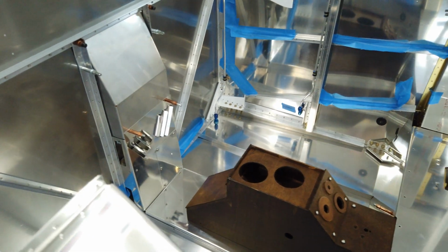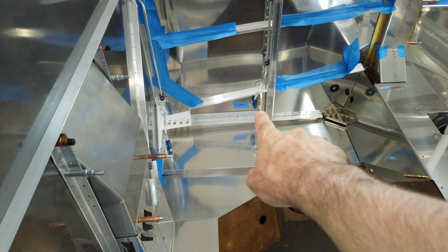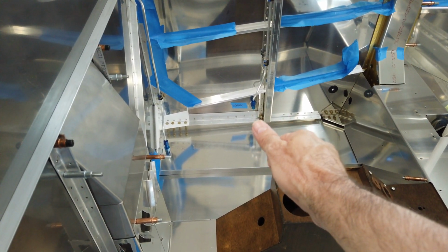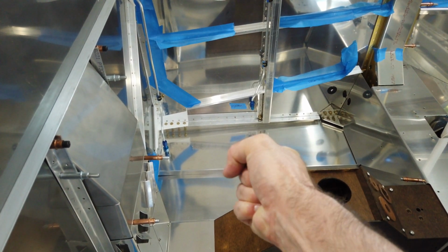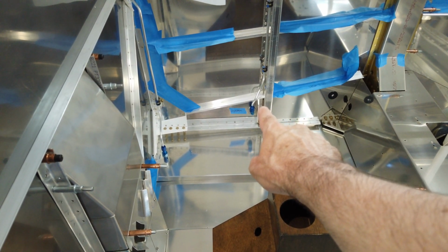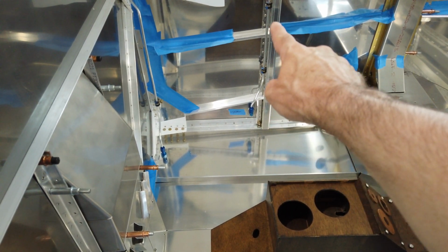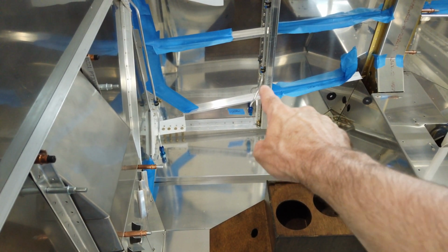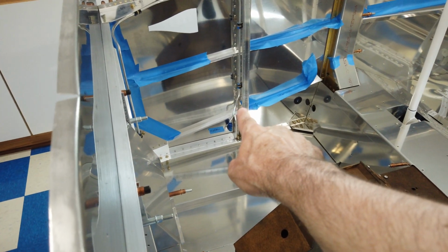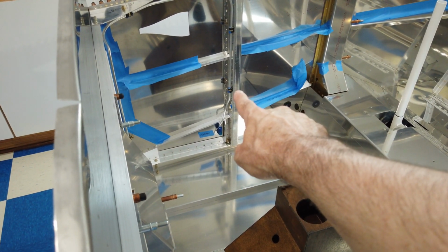All right, so again, if you start at this end here, flare that end, put it on your fitting on a bench, tighten it down, and then use that fitting as leverage and get that initial first bend to clear that aluminum angle piece. And then you got to move the tubing over from here. You got to move it over so it can catch these clamps, and you also have to go around the aluminum, around the hole for the rudder cable, and then back up through the clamp.